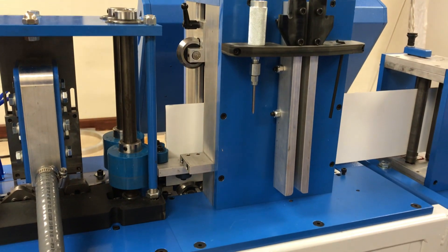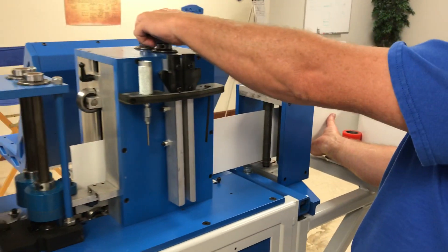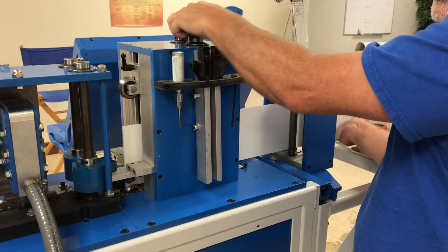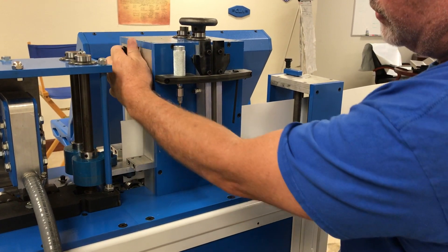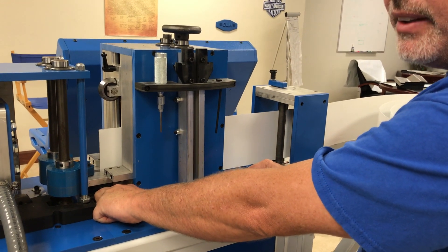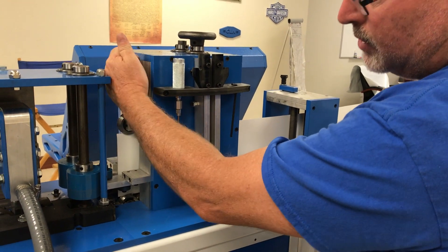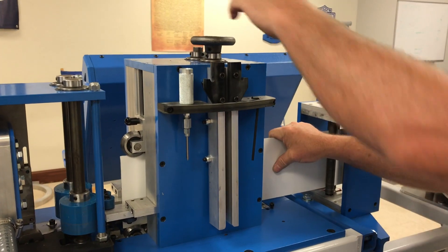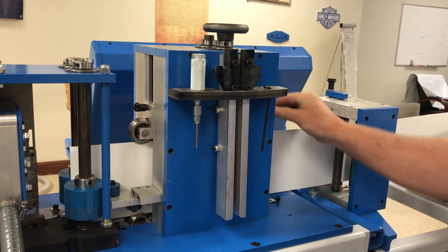Now that it's in the middle, here's the trick: I'm going to lift up on this part of the coil with one hand and rock the material back and forth. What that does is seat this part of the material in that v-groove. I can reach in with my finger and spin the wheel, and I can feel there's contact — I can't spin that wheel, so I know I'm down in the right position. Go back to this side, hold down, rock it, and make sure it's seated.